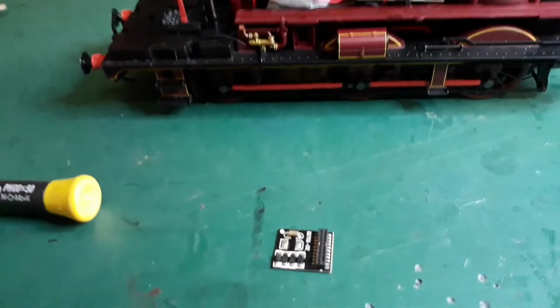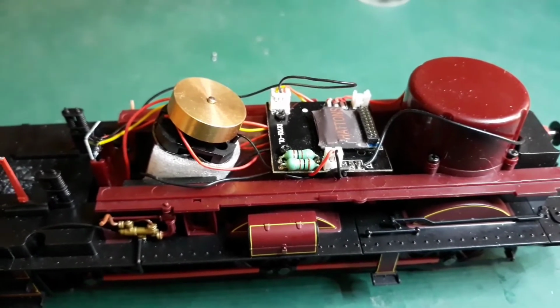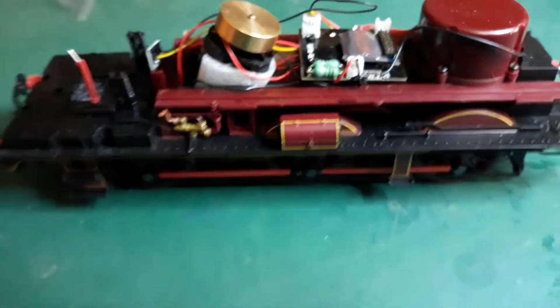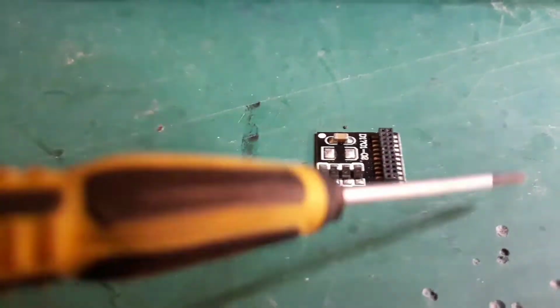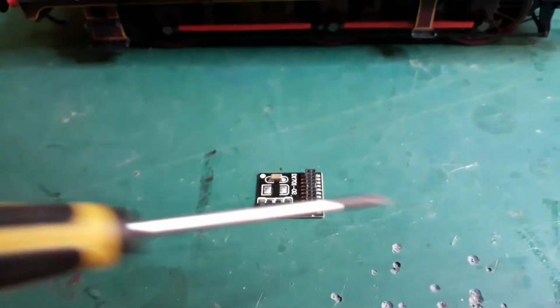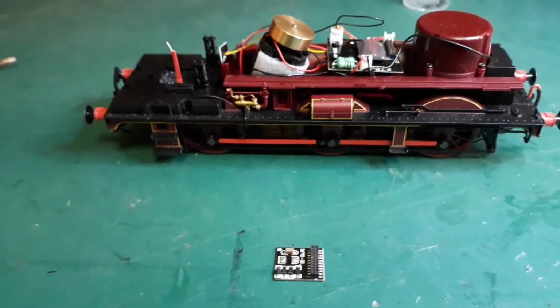But when I got this, the instruction says put the chip PCB down. I suppose that's a PCB and that's a socket, so the PCB goes down. Now, I didn't realise this is a 21 pin chip. This is the blanking plate, and it pushes on, and the pins in there go through here and it just sits on top. I thought the blanking plate was this black plastic thing, so I pulled that off, and then I found there were 22 pins. You can't put a 21 pin chip on 22 pins.